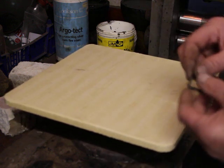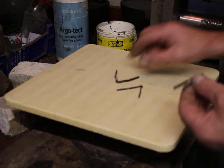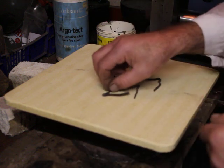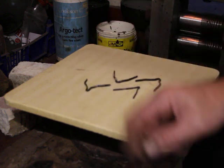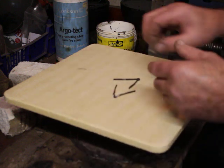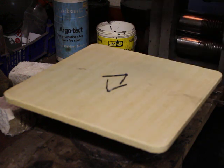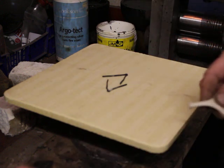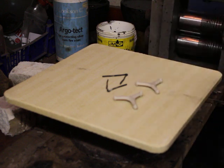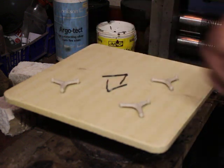You might use other little accoutrements — I often use little split pins and the like to sit the work on. That gives me a gap between the work and the table so the heat can get all around the work. I sometimes use these little items that potters use in kilns as well; they're also quite good for mounting work onto.